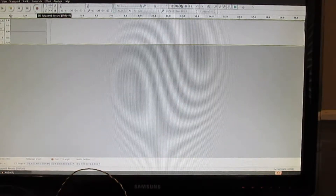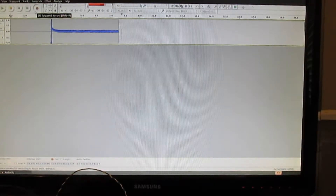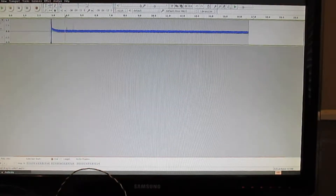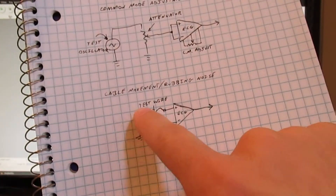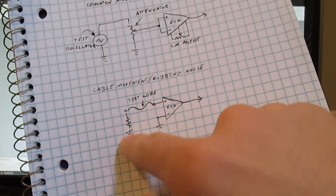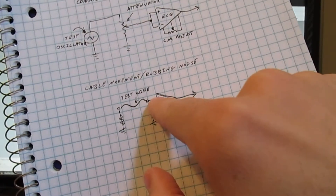Let's try this out. Start recording, power this on, and then I'll start rubbing that insulation — and nothing. I think the reason that didn't work was because I had no resistance in that path, so any piezoelectric effects in this test wire would just be generating currents flowing back and forth to ground without generating any voltage at the input to read.